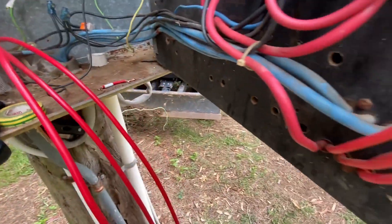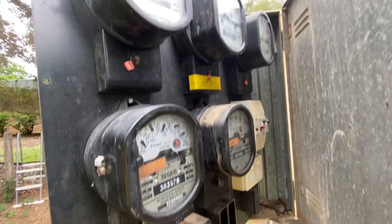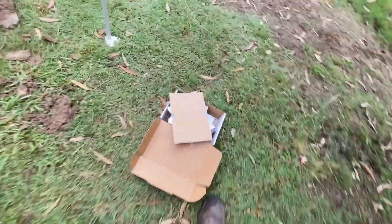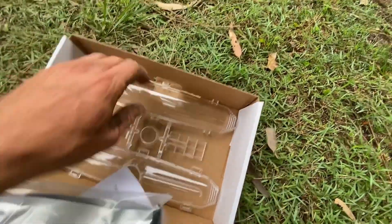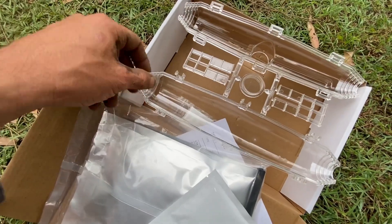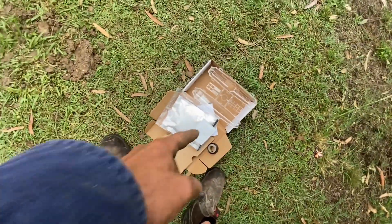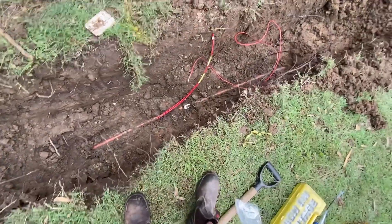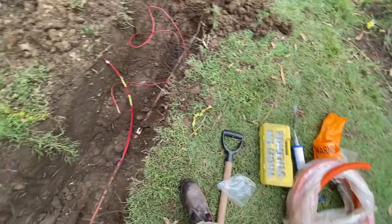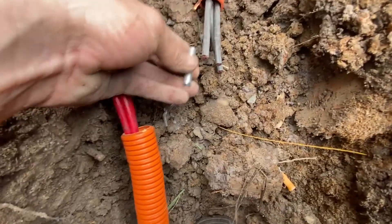I've got my new mains in but I've realized I'm going to have to de-meter this board - I can't use these old fuses. There's a spare on the side here so I'm going to have to pull all these meters off and pull the fuse again. I'll show you what we're doing in here - here's the resin kit. You've got little spaces for the phases, you cut your conduit and fit it in there - it's meant to seal it up. This is where I'm going to do it once the cables are pulled through. You can see the old ones, and we've got crimpers.